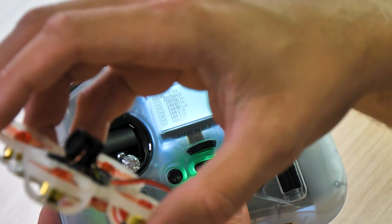This is also what we use on both the Tiny Whoop and the Guardian. SA, which is the button on the very top here, is our arm. The next one over is our rates mode — so if your model uses different rates from Acro to Horizon, you can switch between them. The next one is going to be our beeper, and the final one is going to be flip over after crash. These four top buttons give you everything you need right at your fingertips and it's incredibly convenient.